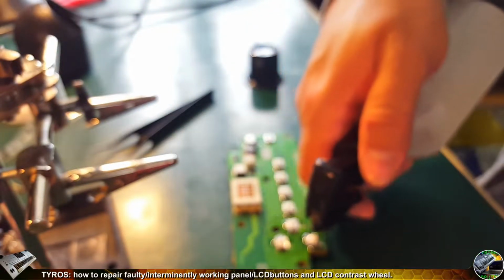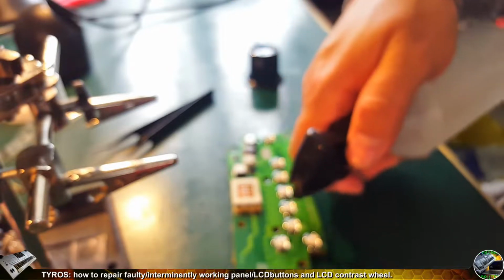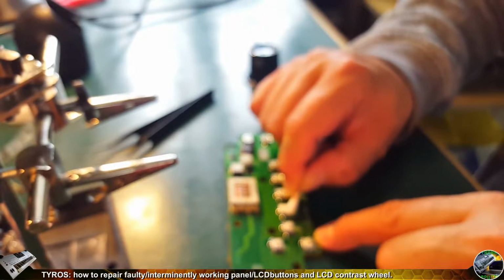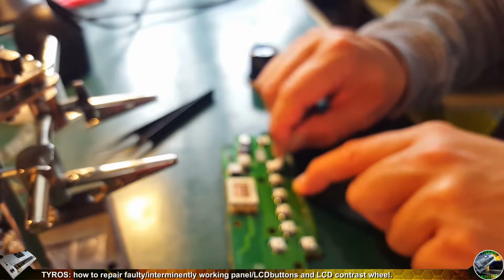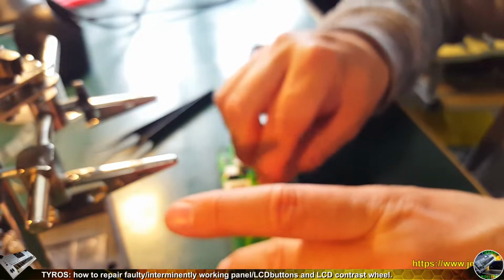And one last thing, isopropyl alcohol. The one I use is 99% pure, which means it leaves no residue. You need to sprinkle switches really generously. This is a hint from my experience, as I was doing such repairs many times. When I sprinkled switches not generously and gave the instrument back working to the customer, they were playing it one day or two, but after that time the repaired switches stopped working again, despite being brand new.